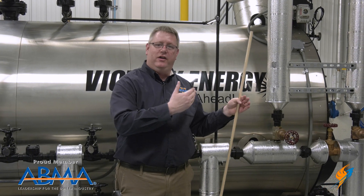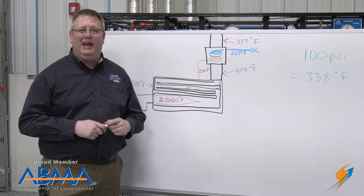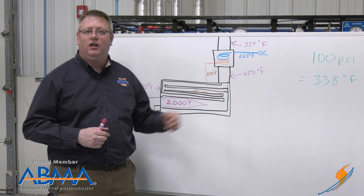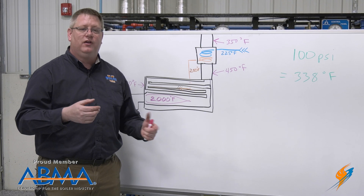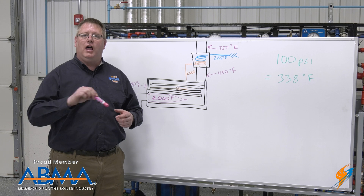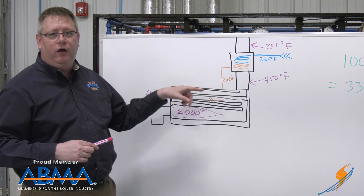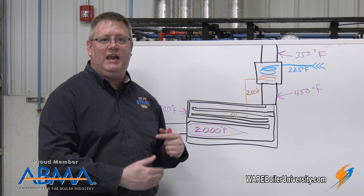Let's look at why this works. One of the problems with efficiency in a boiler is the temperature of the steam we're heating. On a boiler operating at 100 psi, the water and steam in the boiler is at 338 degrees. Because we basically have a heat exchanger, we're never going to get below or even close to that temperature. So what we really need is something at a lower temperature so we can extract more heat — and that's where an economizer comes in. We can bring the feed water from the feed system, which is at a much lower temperature than the boiler, through a heat exchanger, giving us a good temperature rise and allowing us to pull more heat out.